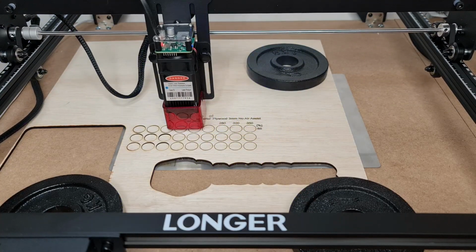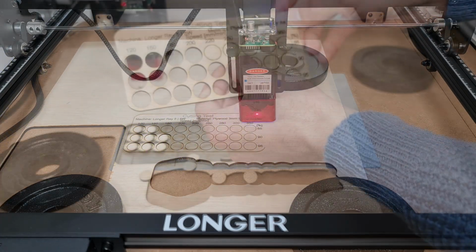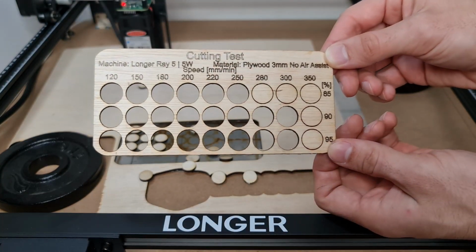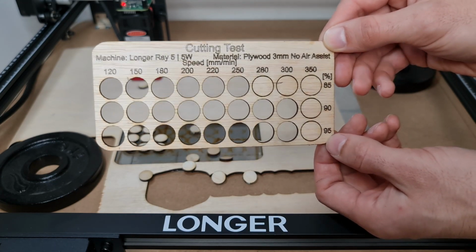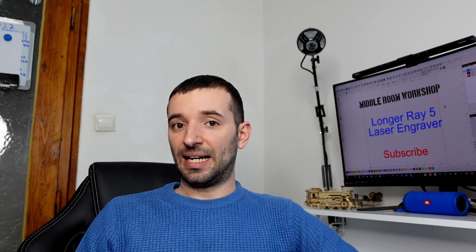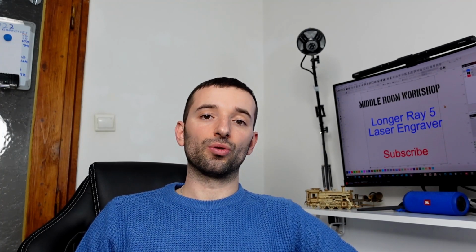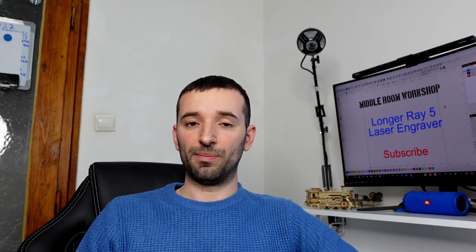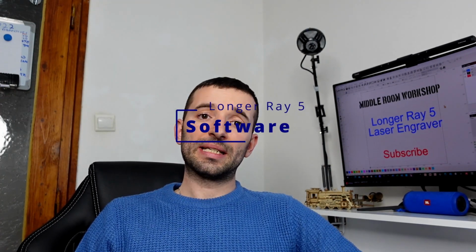It performed quite well, and I was able to go through 3mm of plywood at 90% with a speed of 300 millimeters per minute, which is remarkably high. Now, if you need higher powers, at the time of recording this video, there is no other laser module available from the brand. Other than that, I understood that they should come up with an 8 to 10 watt laser module by May, and so I believe that after May 2022 you will be able to find it available on their website for purchase.